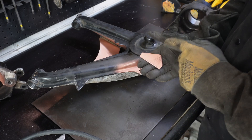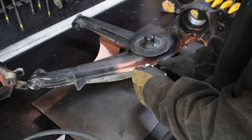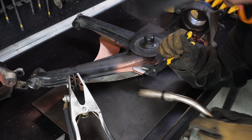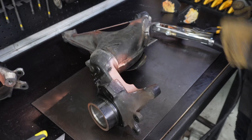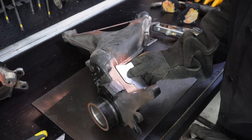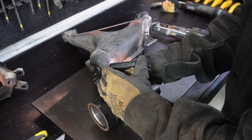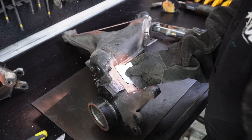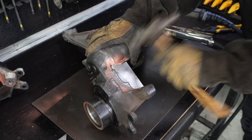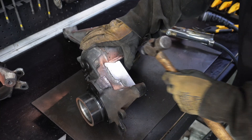Because you're sandwiching two pieces together, you want to make sure that you're putting weld-through primer on both sides. We can drill that hole in a second - we'll get this last plate welded in. This should be the only one I need to hammer down to get sitting nice and neatly. Before anyone says it - I know, I should have preheated this casting before I welded my reinforcing to it. If you're following along at home and you're really concerned about it, look up a video on welding to cast, or let me know in the comments. This bit down the bottom is going to have to be hit up, that bit will have to be hit down. This bit that I'm hitting with the ball-peen hammer never should have been there - it needs drainage in this corner. I shouldn't have designed the template that way.